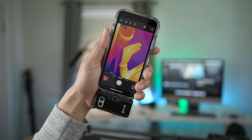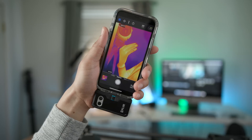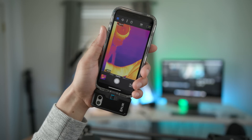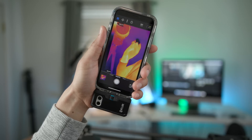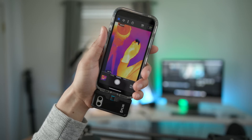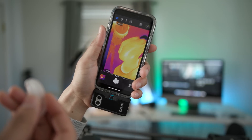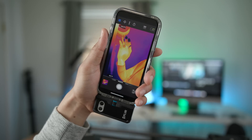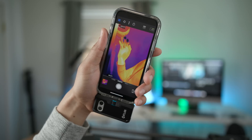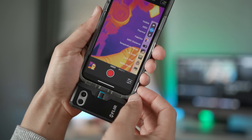The really nice thing about the FLIR One Pro is that it features two cameras — one is just a normal imaging camera, and the other is the thermal camera. That thermal camera is what allows you to see different heat signatures of everything in your environment. You can see I'm holding a piece of ice right now, and you can see the contrast between my hands, which are warm, represented by warmer colors, and that piece of ice, which is cold, represented by colder colors. You can see even my fingertips are still cold from that ice, and it displays right there inside the viewfinder. That's just, of course, the tip of the iceberg.